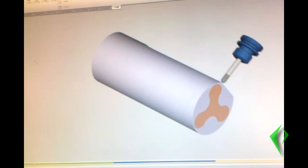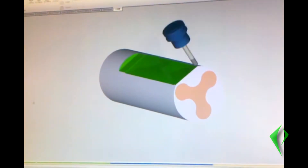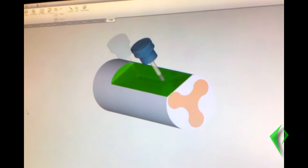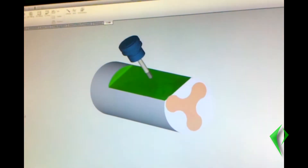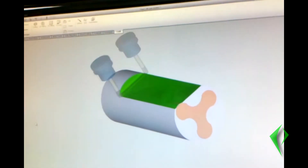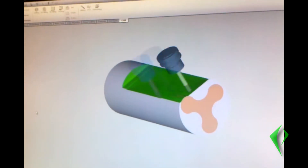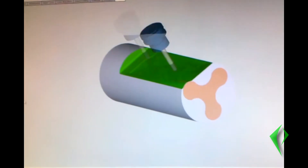While this video is not exactly how we do it, this is basically a 6 inch bar stock piece being cut. We would actually have a casting with a lot less machine stock. We'll also be coring out the rotors which will make them hollow when they're cast, that way it will reduce a lot of weight. But this is the simulation of what it would look like if our machines were cutting them right now.